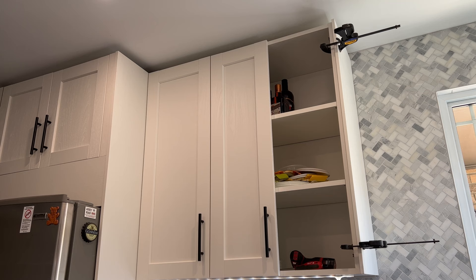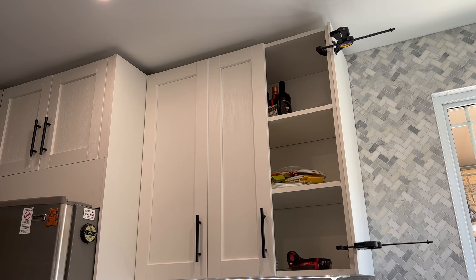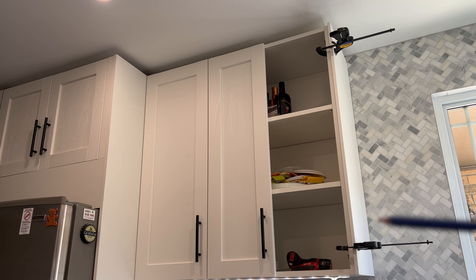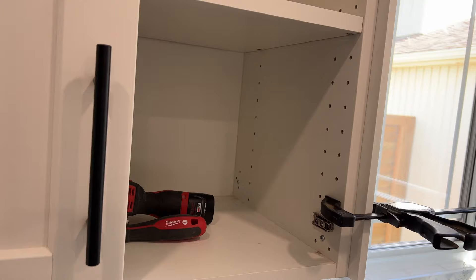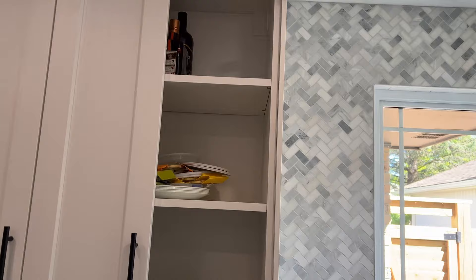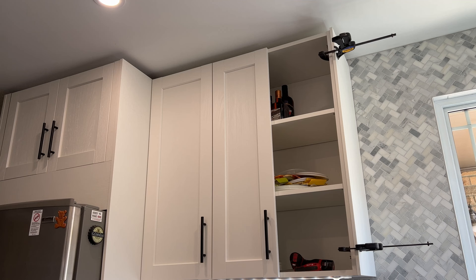What we've done is we've actually ripped and cut down this end panel. I had to rip it down because I've got backsplash tile on there, which adds about a quarter of an inch — so that's approximately what I ripped off. Rip meaning cutting along the long part. I cut it down to the height of the cabinet, which is 40 and 1/16 inches. Throw some clamps up in there, use the supplied screws — you can change them to white screws after — and we're now ready to start measuring for our Enkoping deco strips.